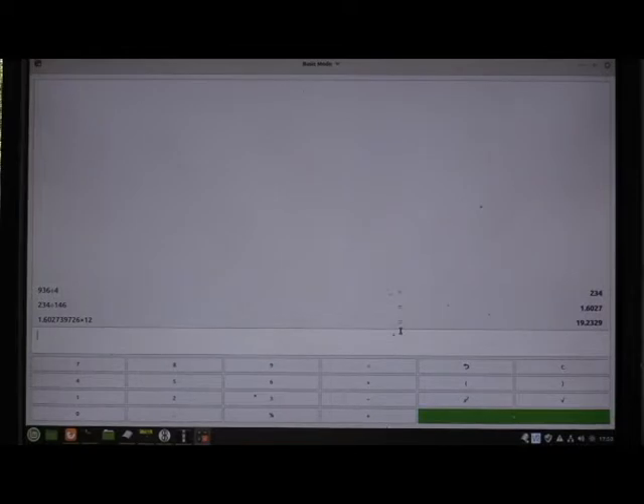In part one, I told you about a magic number — 936 — and that number is where you start figuring out how long your antenna wires need to be. As I put these together, I tried my very best to put this antenna together just like I'm going to show you how to do it. I measured my length out, and remember 936 gave us an overall antenna length of roughly 19 and a quarter to 19 and a half inches, somewhere around in there.